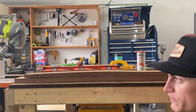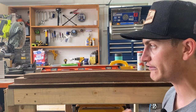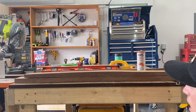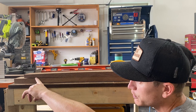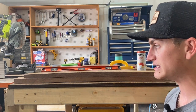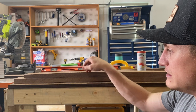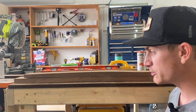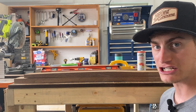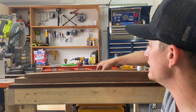Some of the reasons I think this happened: I was putting too much pressure on the outfeed table, which aggravated tapering at the leading end of the board. The taper only affected the first inch or two, then thickness became constant. What I discovered is that if you start with a significant bow you need extra stock on the ends so the tapering doesn't eat into the usable piece — you'll trim that taper off. That's what I did with the piece that actually worked.